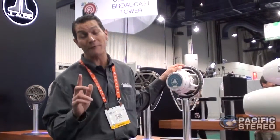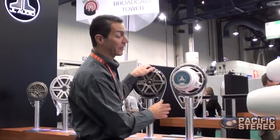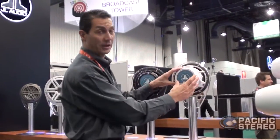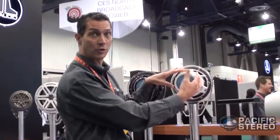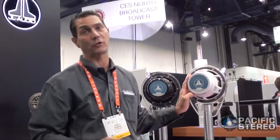When you take a look at a massive speaker like this with excursion that rivals some of our subwoofers, you wind up with a very capable product. The low frequency content capability goes down to about 38 cycles. So although you still want to use a subwoofer, in some cases you'd be surprised what you can get from an 8.8. Behind this casing are all the crossover components in a sealed chamber, and all the connections are made right here on the bottom for a nice clean installation. So if you've got the room for an 8.8, it's definitely something to consider for your boat.